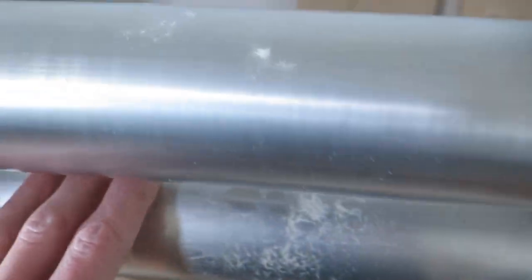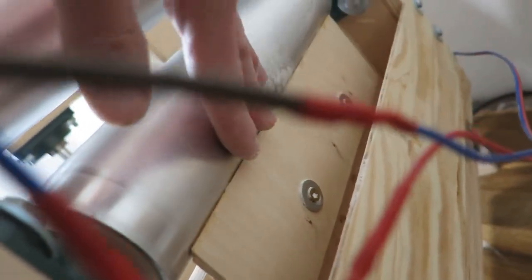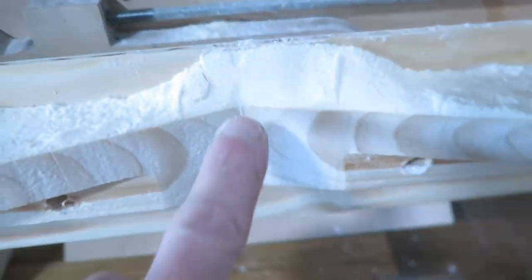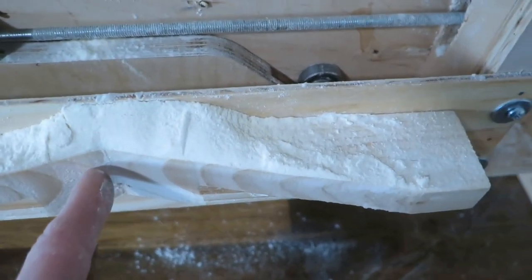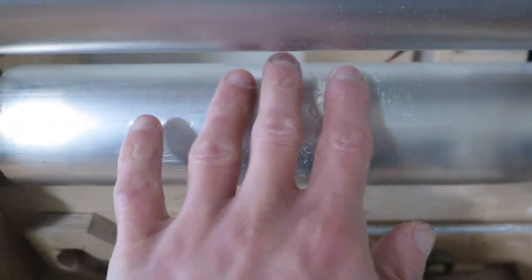Now this makes a sound, and it shouldn't, and that is because there is a block of wood which is supposed to scrape or prevent the dough from sticking to this roller and going through the other side, and there is basically a hole. And a chute, and this chute is not necessary, but it should serve the purpose of spreading the flour on the dough around, which it doesn't really do. This thing, same thing, apart from the spreading of flour, it provides some way of centering the dough on this roller so they don't travel. But since I don't adjust these bearings very well, it does travel. But otherwise this works well.